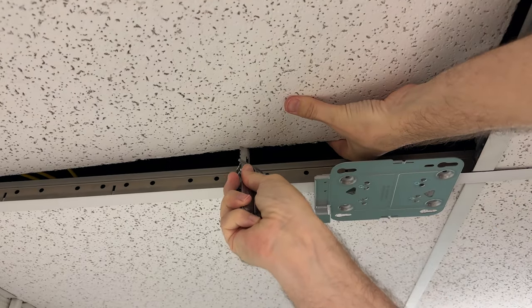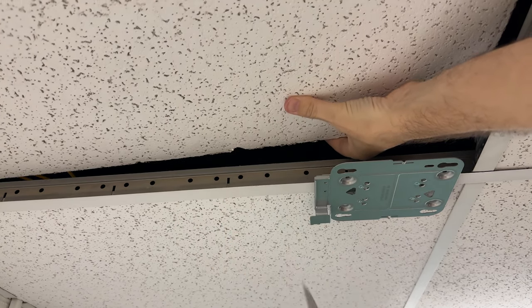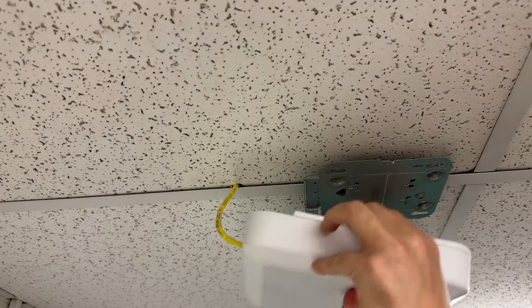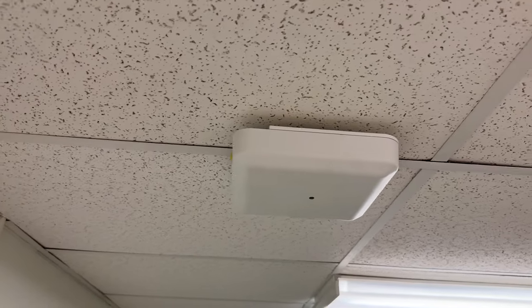I'm going to take my pocket knife and cut a small triangle out of the ceiling tile here. You don't need too much, just enough so that the cable doesn't prevent the ceiling tile from laying flat. From there we just fish the cable through the hole we made, connect the cable to the access point, and then reattach the access point to the mount. Using this method you should be able to put the ceiling tiles back the way you found them and have the cable concealed behind the access point.